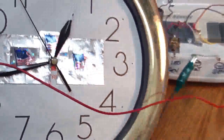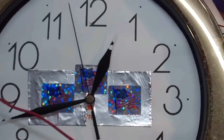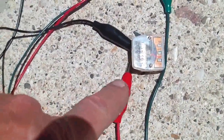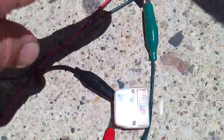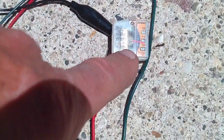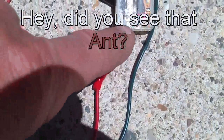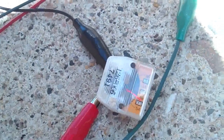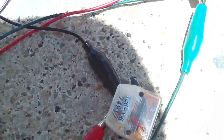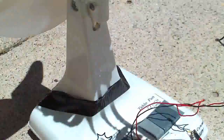How about a wind-powered clock? Here's another cool thing I've found for this: if nothing else, it makes a good wind meter. I've put a variable resistor here — this is just temporary — and this tells me the wind speed, so I can calibrate it. You'll see the needle going up and down with the wind. I'm figuring right now we're somewhere around ten knots, and over ten there for sure. This thing is cranking on, charging the battery all along the way.